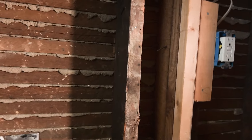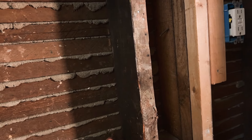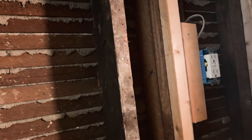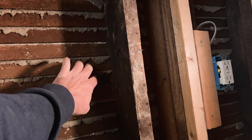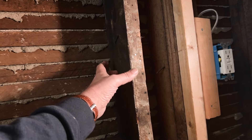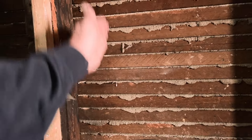To get the medicine cabinet to fit, I'm going to use toe screws here and here, then cut out with a Sawzall and rip this board down in situ, because it's not structural — the only thing it's doing is holding some of the plaster laths. I just need to leave about two inches of it, and that'll give me the depth to put in a medicine cabinet where I want it, with another piece added to frame it out.